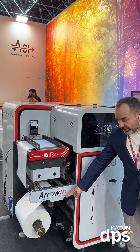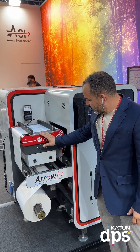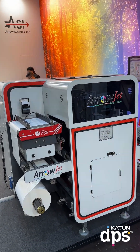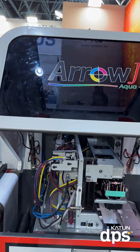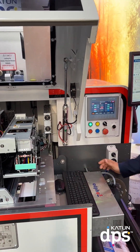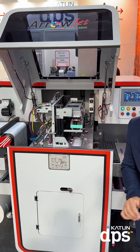Industrial built unwinders down there, 330 width, 500 millimeter diameter rolls, web guides — professional industrial build, high quality web guides. We have the printhead, the print engine, and under the cover we have a Duraflex printhead CMYK. We have some optional accessories such as a dryer, which we will not use today — we will run at 60 meters per minute with no dryers.